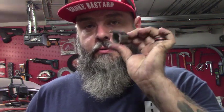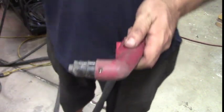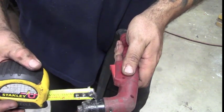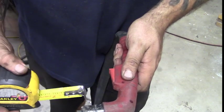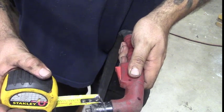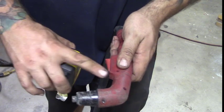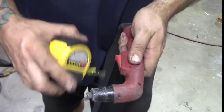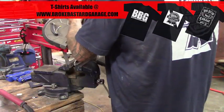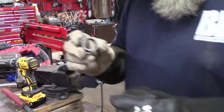That guide is what's going to help you make nice circles. First thing I do is measure the tip. It's going to stop at the collar, so from the collar down to the tip of the plasma cutter is one inch. I'm going to stop the collar at three quarters. The reason I'm doing that is so I can actually see what I'm cutting — if it's all the way down I'll never see what's going on, and it could get caught up on the slag.